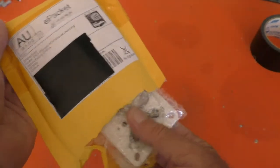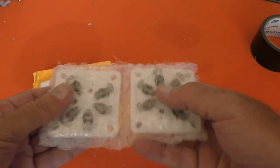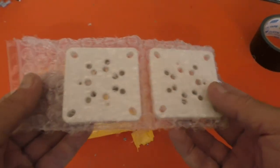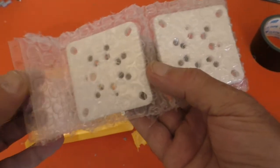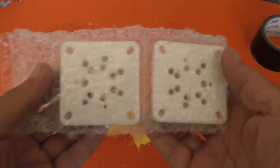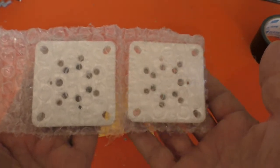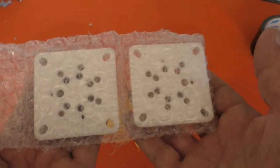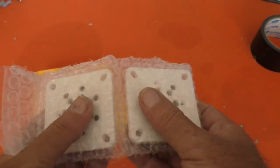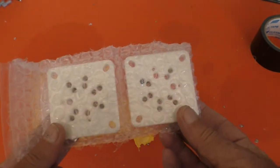This has come from China and it's the valve bases for the RK71s. They're very nicely packaged — look at that, beautiful, not a crack. So these are the valve bases for the RK71s, very similar to the 813 tetrodes, but the RK71s are pentodes. These are going to provide the screen grid modulation for my GU81Ms.